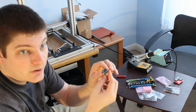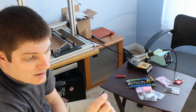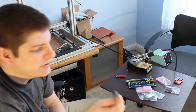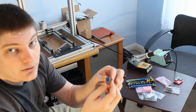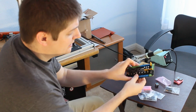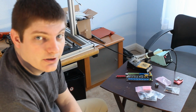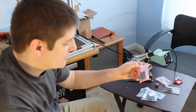They flipped everything over from the traditional version of these kind of broken out chips, and it seems like a good idea since I'm going to be running them pretty much flat out at 2.5 amps. That's pretty important to me that I have good cooling, so I'll put an active fan on them as well and hopefully get them in an enclosure at some point. But early on I can always limit the current. This board does actually do digital potentiometer current limiting from firmware, which is pretty cool too. So I'll probably just run it flat out, but if I was really using the current limiting, that would be a pretty important thing for me. So I mean, it's pretty cool.